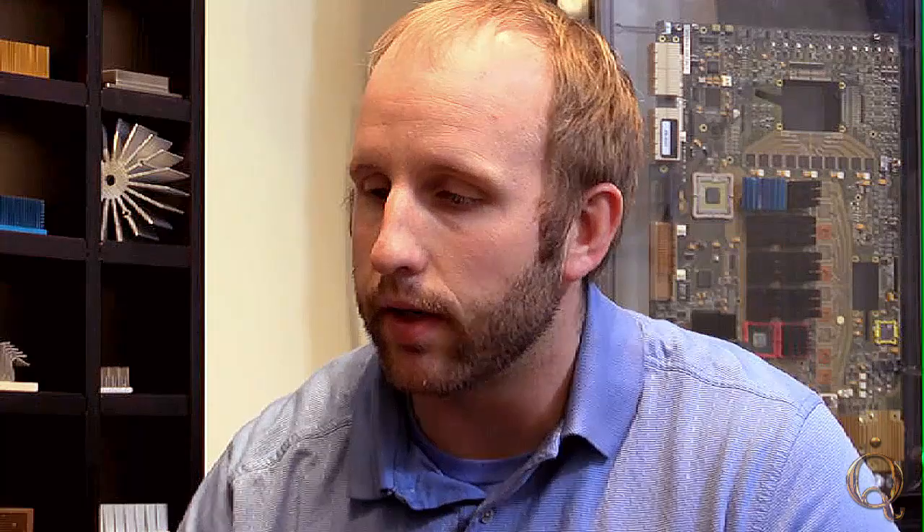And it's one-time tooling, low cost production. This particular one is an all-copper solution with a stamped flat base and a standard copper zipper fin profile that's soldered on. It's a multi-step process where you make a long zipper, break it off to your specific width, place it on the heat sink, and wave solder. When performance is critical, these are performing some of the best numbers for heat sinks per given envelope, because we can significantly increase the aspect ratio, reduce the fin thickness, and also the fin density.